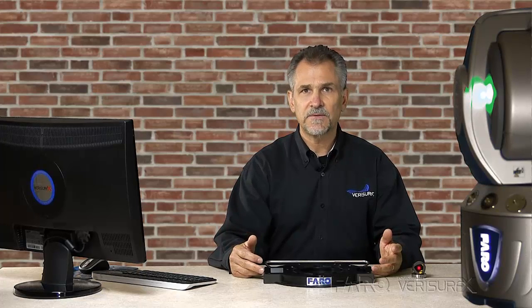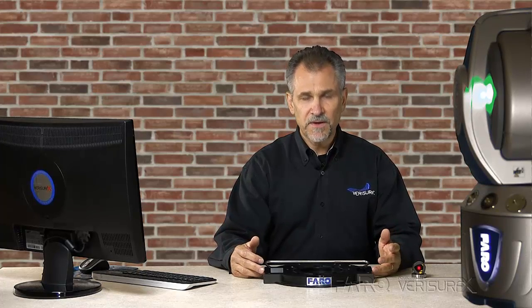We'd normally start by aligning the device to the basis of the CAD model by measuring features with known CAD values. We did this in AutoAlign. We'd then build parts into position by moving them to their nominal locations. Since the tracker is already aligned to the basis of the CAD model, we'll simply move the part and use build mode to put it back into position.